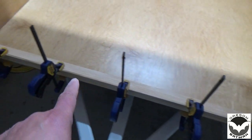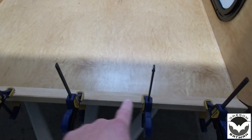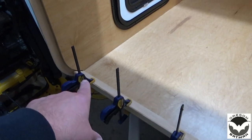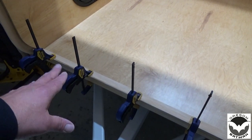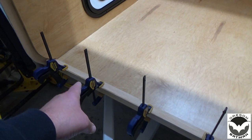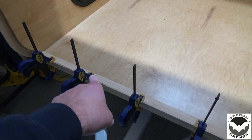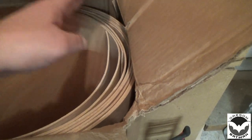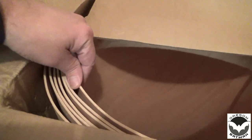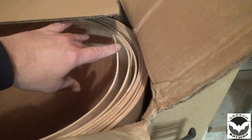Now I have my spar here positioned in place, got it clamped. We're going to go under, pre-drill, and then insert our fasteners and this piece will be attached. The gap here — it's not a crucial piece, it's behind the wall, nobody's going to see it. I'm just using it so when my ceiling comes down and meets the floor, it has something to rest on and I can glue and attach along that edge. The ceiling wood I'll be using is one-eighth of an inch bendable plywood. I could have probably got away with a quarter inch, but I'll just use the eighth inch — it'll be easier to work with and bend around with no problem.